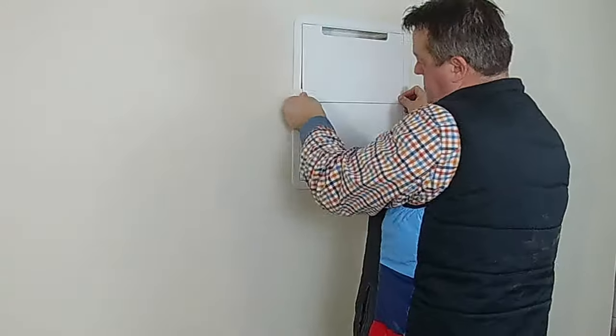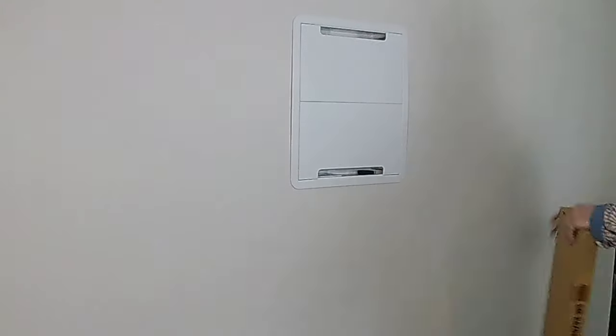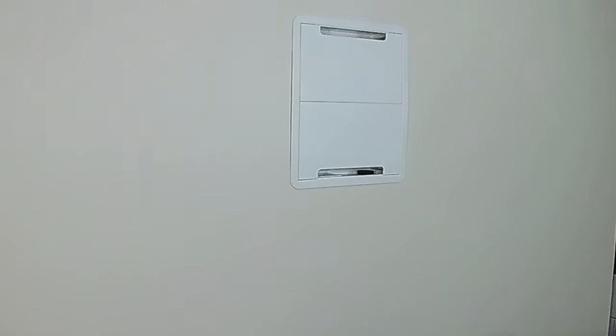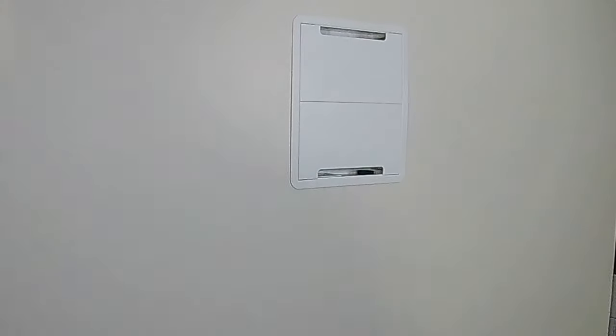With a frame TV, you can't see it, so technically you could leave the cover off. We actually leave it off on certain jobs, especially if it's a Comcast cable box or something in there along with the One Connect where it needs a little extra cooling. Then you can see here I'm just vacuuming up and cleaning up, and the enclosure is all complete.